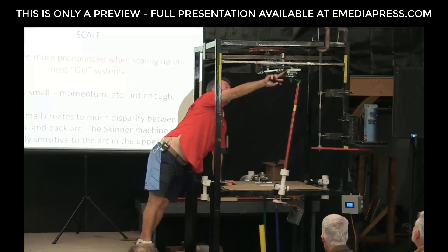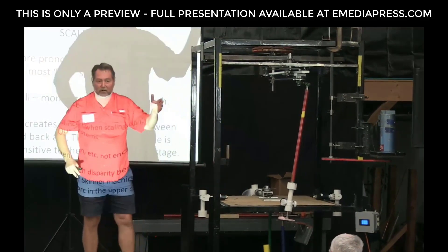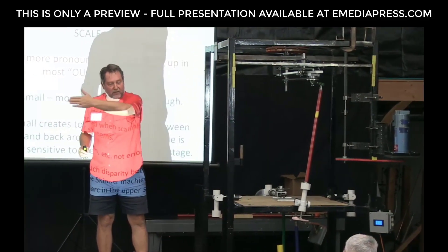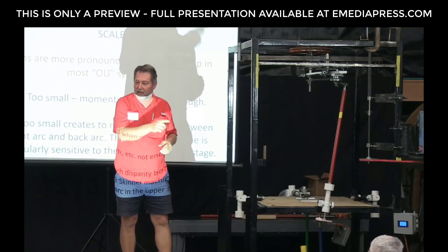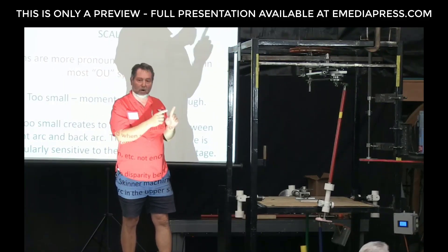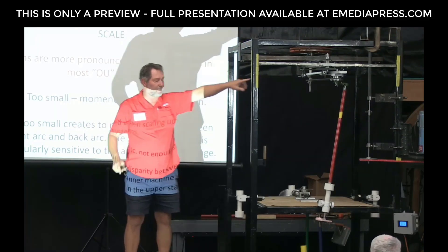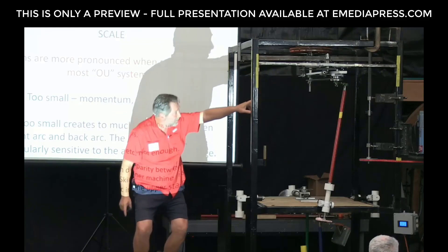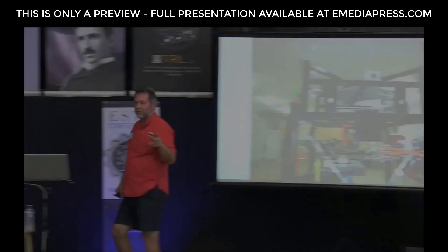You can all come up and take a look at it and take pictures. This little thing here makes it go back and forth — when it's on the outward one it goes faster, and when it comes through the back it goes slower, so you get this disparity of speed. The only way to reduce that change is to lengthen the arm. You'll actually find a hole here showing how much I increased the size.